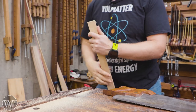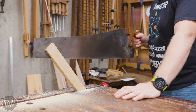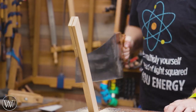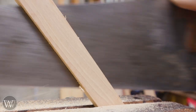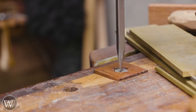This is going to be a re-sawing process, but even with a thinner stick it still requires the same focus. You want to come right down the middle — any time you move over to one side or the other, you're going to be reducing the thickness of your sticks. So keep a nice true line, and every so often stop, rotate it around, and come at it from the other side. That way you're always tracking on the line on your side of the board until you pop right through. Four foot of cut, and done.